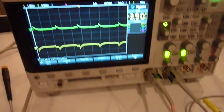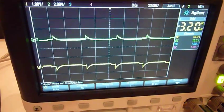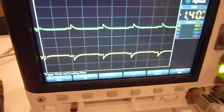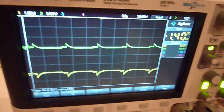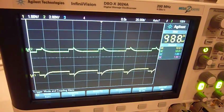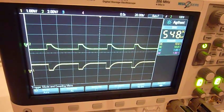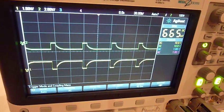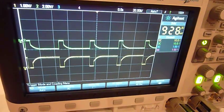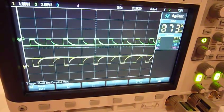And you can see it here. Now I readjusted it, so the start DC bias is almost where the YTO lock ends up. I can actually move it here. If I move it, you see how it changes the start point from which the phase lock loop has to catch the YTO. So I'll just put it back to someplace close to where it's almost there to start with.